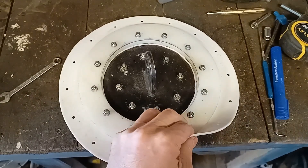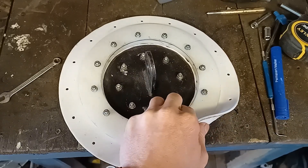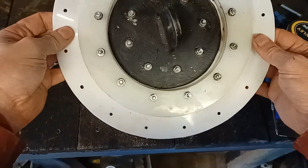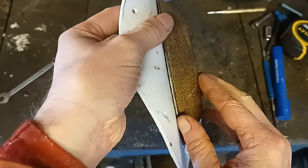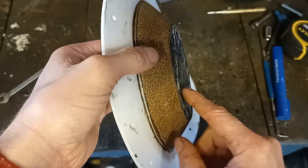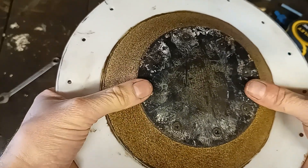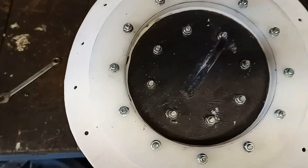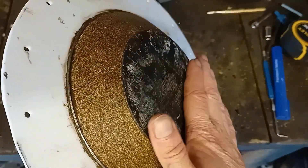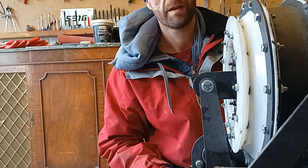So this is the new seal that I've put on - three millimeter silicon rubber, not reinforced or anything like that, so it'll be quite interesting how it deals with the pressure. I've also replaced the spacer piece with a piece of microlight so it can handle the temperature a bit better. The piston is a bit heavy really but it's what I've got for the moment. If I went to build the engine again I'd probably make it in a completely different way, but that's development for you.